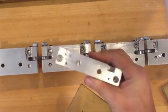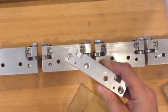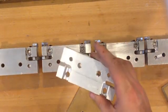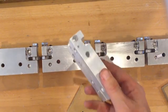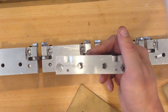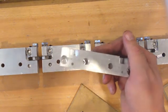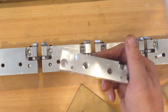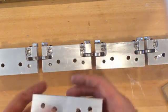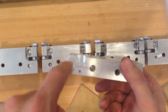So after doing all that, I went in and drilled everything. One thing I'll say is if I could do this all over again, what I would do is drill the top ones all the way through. For the side ones — the two-inch — my drill has exactly two inches of travel, so it wouldn't go all the way through. But if you have a drill press that will do two inches of travel, I would just drill a pilot hole — the smallest diameter — all the way through, and then go in with bigger ones.